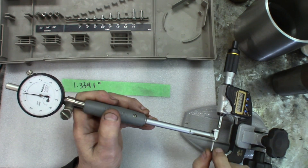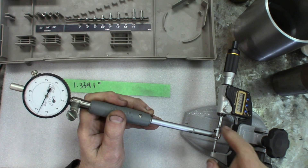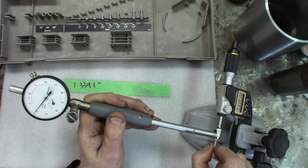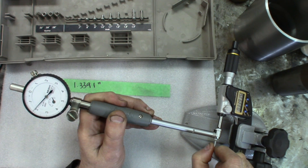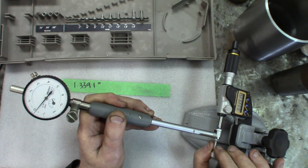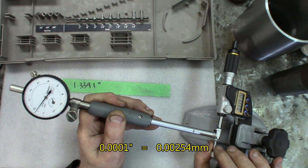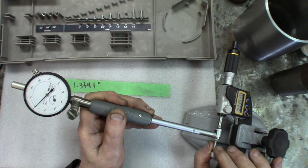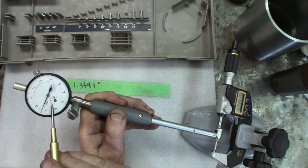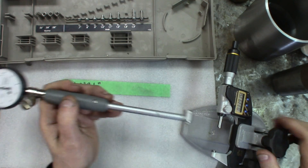So we've got our value there, and what we're going to do is insert this in there. The distance between those two parts here is exactly the bore we need to control. What we need to do now is get the maximum deflection on the gauge. The maximum deflection would be just there. I'll put the zero near where it is. We get maximum deflection on the dial there. It's zeroed — and make sure that second dial there, which is just past four — make sure you go back to the same place, because you can be ten thousandths off if you don't respect the right area.